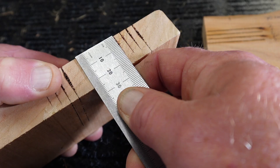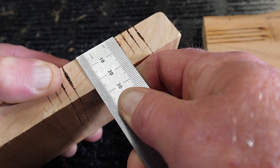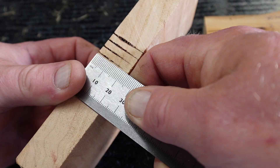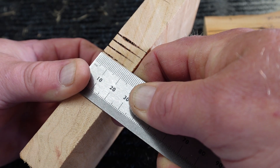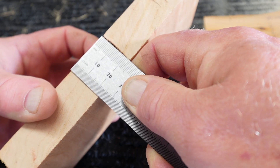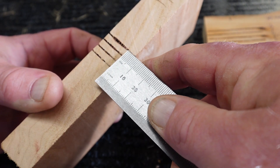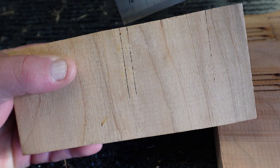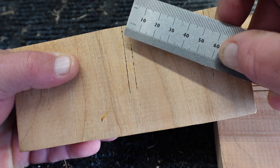Over at five millimeters a second, the cleanest cut went to about 10 millimeters deep, with the thickest kerf reaching about 16 millimeters. Looking over at 100 percent power, at five millimeters a second the final edge of the cut was about 17 millimeters deep. At two millimeters a second we also got about 17 millimeters. Looking at the back side, at 100 percent power and two millimeters a second there's a visible mark on the back as it almost cut all the way through.